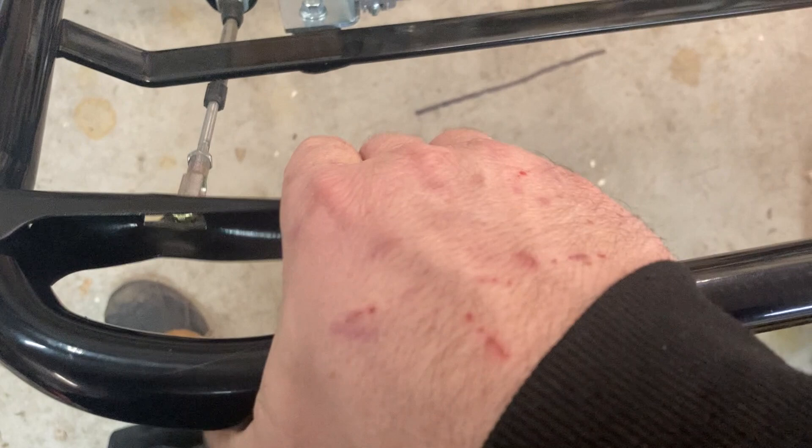Normally you would pull this handle to release the brake. This is still spring-connected going down to the transmission, but I have the rod that goes to the brake on the transmission disconnected, so there's no brake on this for the moment. That's just to make it easier so I can work on this without having to hold this in to let it move.